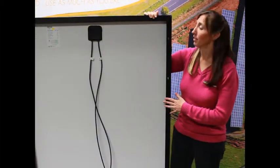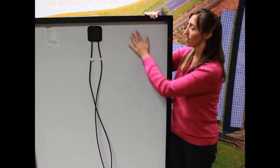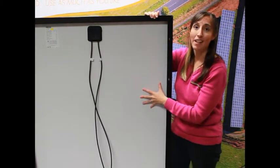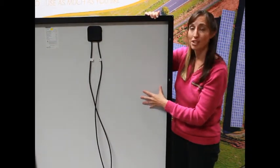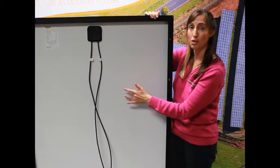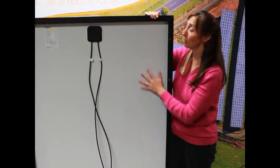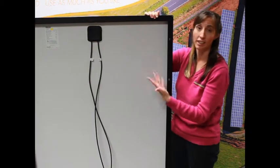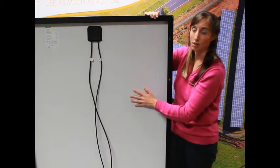This is the back side of the solar panel. This area here is a polymer back sheet that they use, and it's one of the more delicate parts of the solar panel. It's something we always have to watch out for when we're installing, because if you're not paying attention you could have a mid clamp or something sticking up from your racking that can tear this back sheet. Once this is torn, the panel is no good anymore — water can get in it and it won't work.